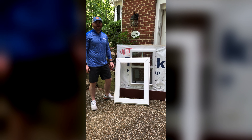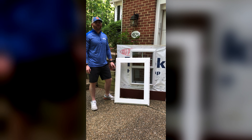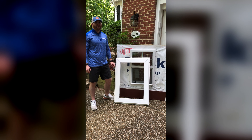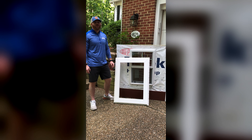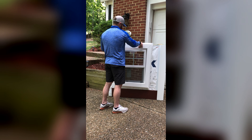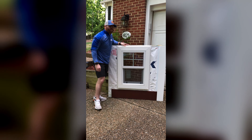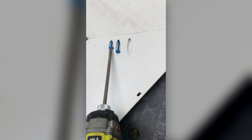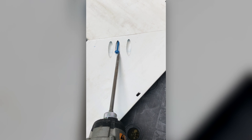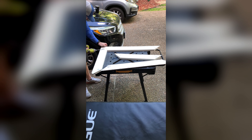Prefabricating your surrounds will save you valuable time on the ladder. When used with quick corners, your siding will fly by in a flash. Take a look at my window surround fabrication — using the pocket screw system allows you to build multiple surrounds on the ground, taking one trip up the ladder and installing all of them at one time.